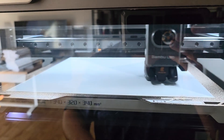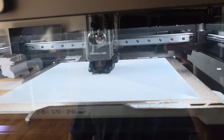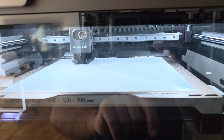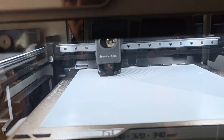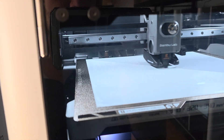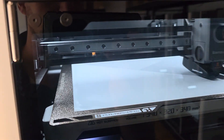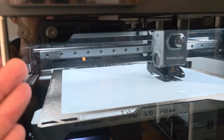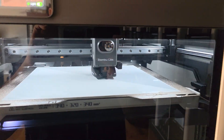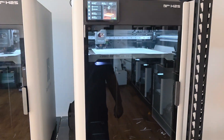What I'm mostly concerned with is that it's putting the nozzle a little too close to the bed, which eventually will wear out my print bed. Trying to take that off — if I don't have enough good release material, like that nanopolymer, it's going to potentially be hard and rip the bed up or rip the part off and break the part.